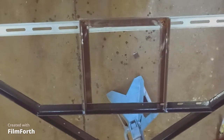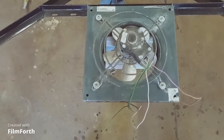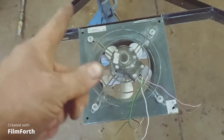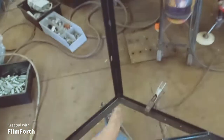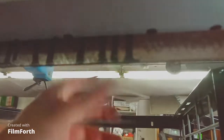That's the opening where I'll put the fan in — we'll weld that in and set the fan in place. It fits. I don't like how the wires are orientated coming out this way, so I'm going to take those four bolts off and spin it around so it's pointing up, then run the wires up along this track. I'm going to put the switch by the door somewhere — I'll make a little piece that comes out so I can mount the switch on it. So you can open the door and change the temperature if you need to.